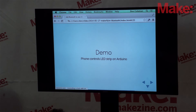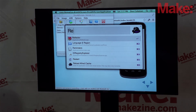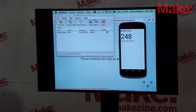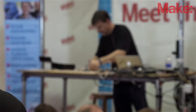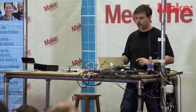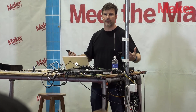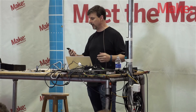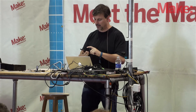So now if the demos cooperate... Unfortunately the phone isn't mirroring on screen so I'll have to hold the phone up. This is another application written in PhoneGap. Bluetooth Low Energy works a little bit differently — instead of pairing, you go out and discover and then connect to services. In most cases you can use what's called JustWorks and there's no pairing at all. The app gives me a list of Bluetooth radios to choose from.